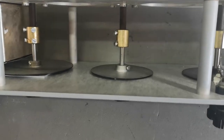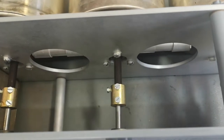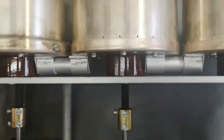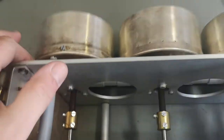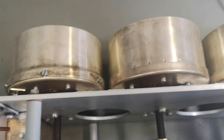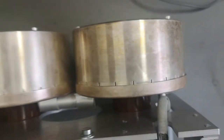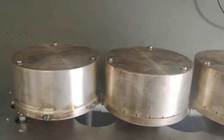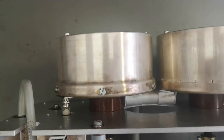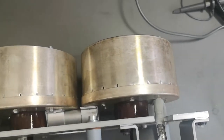It is built super, super nicely. The numbers are CNC'd — milled in. We've got this isolated shaft going in here and they are all isolated from the chassis. There are coax connections and this is again 600 ohm in between everything. The shielded boxes look a little bit different — this is the 10 dB one with screws around it, and this is the 1 dB and 0.1 dB stepped attenuator.